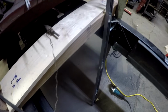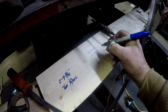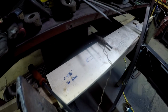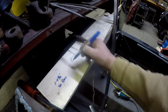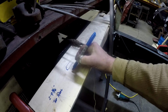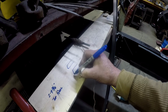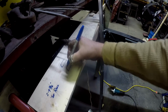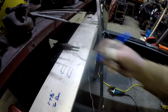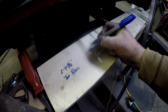And if you don't know what I'm talking about, it's an over exaggeration on how thick the frame rail is. What I did is beveled it out, but there was a straight edge on the bottom part of it. So again, when I went in, I left that straight edge, that land in there, so that I could line them up. If you had tapered it off too much, you might distort the length of this piece or the length of the frame rail, and you won't get an accurate fit up. So you've got flat spots, square flat spots butting up against square flat spots.